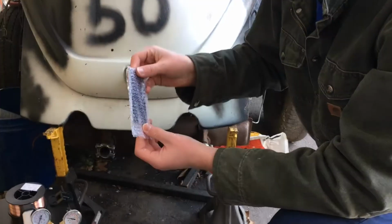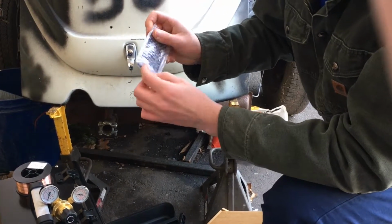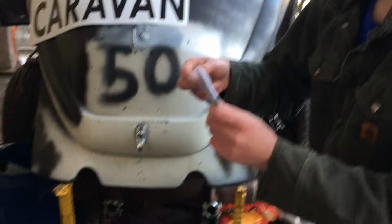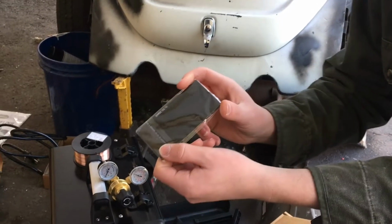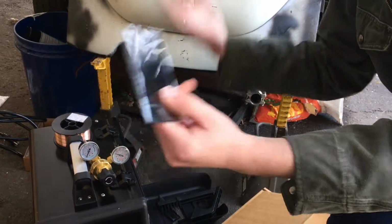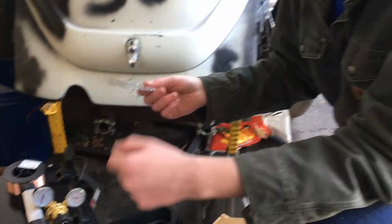I'm gonna actually see what number it is. I said it might be a 7, but it might actually be like 11 or 13 or something crazy. So let me get in there. It's going to be a pain to come out. Right here, shade number 10. Okay, it's a number 10, not a number 7. Once again, though, I still wouldn't recommend using it. You still might get flashes of light around the sides, something like that. So really get a legitimate helmet, not just a handheld one.